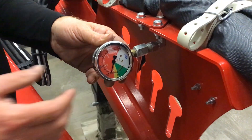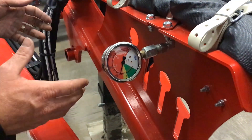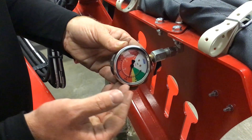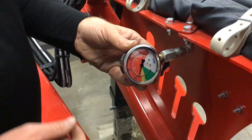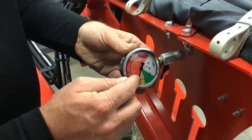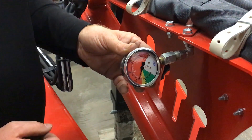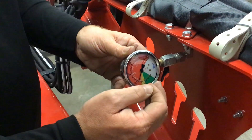As I mentioned earlier, the maximum pressure we want to use when transferring weight from the mainframe out to the wings is 500 psi. Coming back to this gauge, you can see here the green area going up to 500 psi, a very narrow yellow area which is kind of a danger zone, and then also the red area — once you get above about 800 psi, that's the no-go zone. One of the common mistakes we see in the field whenever customers unfold the machine is they do not put this hydraulic remote into float. Once you get into the field working, be sure to look back and ensure that this gauge is either in the zero position — which would be the float position on your tractor — or within the green zone. If you're out of the green zone, put the system back into float and then readjust to the pressure that you desire. In probably 90% of the field conditions you'll be encountering, the float position will be the position of choice.